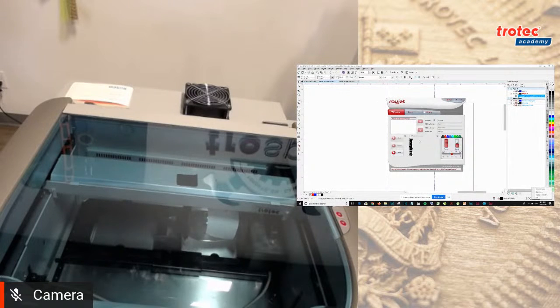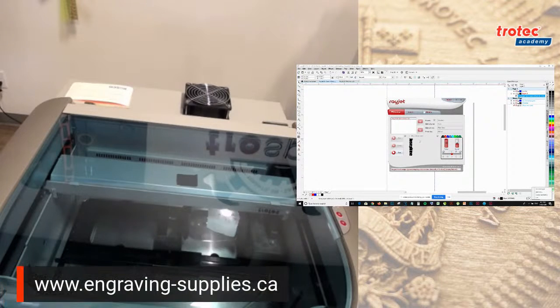Whenever you're engraving on glass, make sure that you're applying moist newspaper or masking tape. In this case, we're using our transfer tape, which we sell. It's really good for engraving products like glass. If you don't apply that layer, you get this serrated engraving finish.